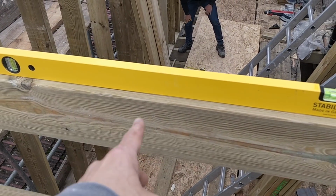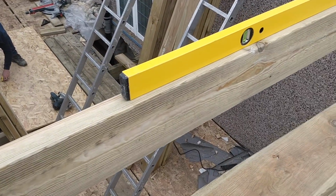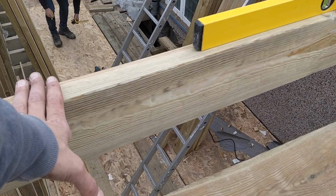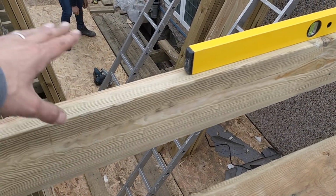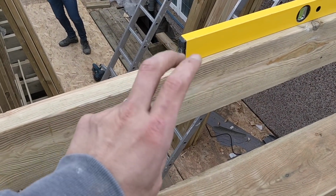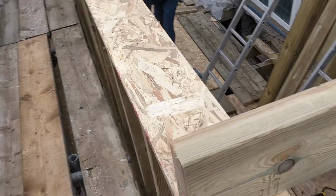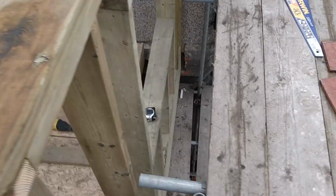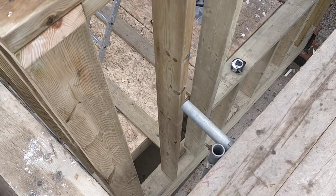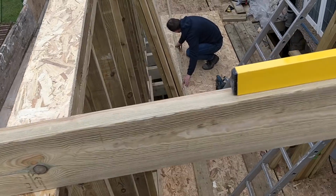So, you know, I've done 2x6s, so I've gone well over and above what I need in terms of strength, and that's so that I can fill the whole thing with insulation and put boards on top rather than filling up to and over the top with insulation. So I'm well above code with the insulation in between there like that, and this is absolutely fine. It's exactly the same as we did with the flitch plate down there, where the brick was a little bit higher, so we packed it out with an 11 mil sheet of OSB. Here it's just 18 mil, so it's good.